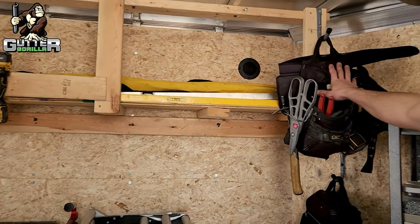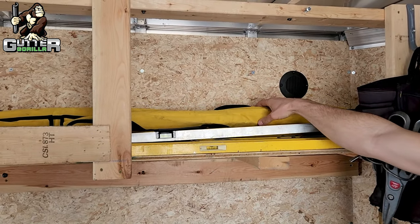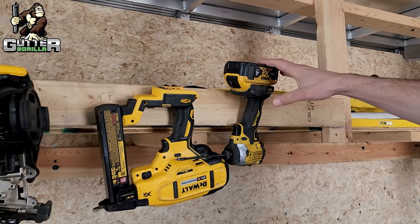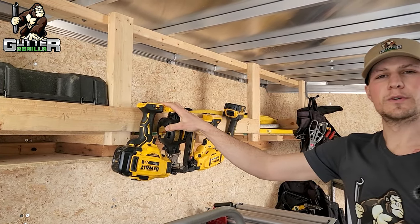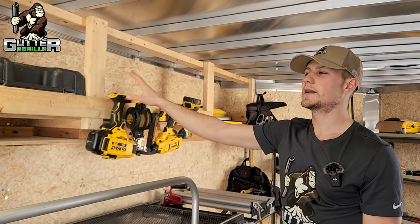All the pouches go up at the front and on top we have a bunch of different levels — some for siding and the shorter ones we use to level the gutters. All our impacts will be hanging here. We use a stapler for our soffits. This roofing nailer we use for vinyl siding — we have a tip that goes on there that works for vinyl siding, and we really like that.